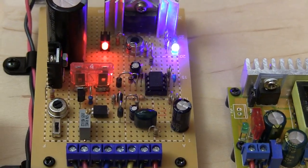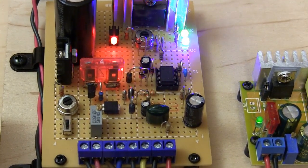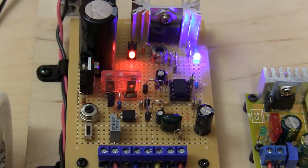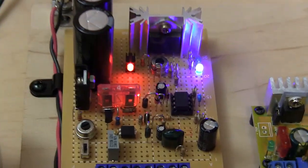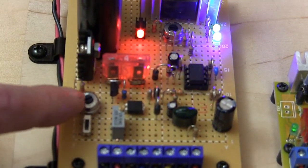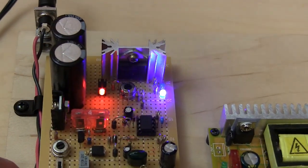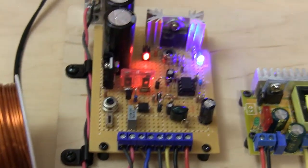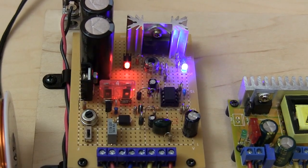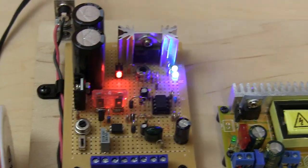The timing and the voltage are both adjustable. You can run this super fast — at 10 hertz with the current settings — or all the way out to 44 seconds between pulses. So depending on your application you can make a very fast pulsar just by adjusting the potentiometers on the circuit board. I've got one on the left for the voltage, and then in the back there's the timing — a 100k potentiometer. You can put any potentiometer you want there and raise or lower the frequency. It's a very practical circuit with a very wide range of operation.